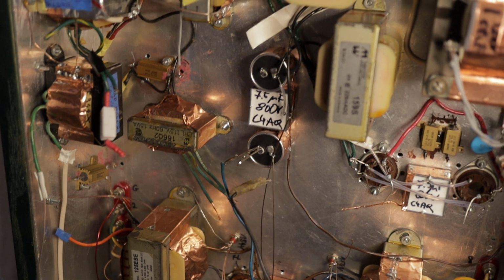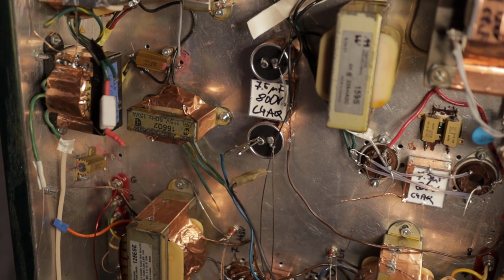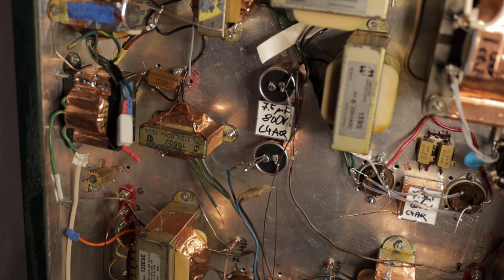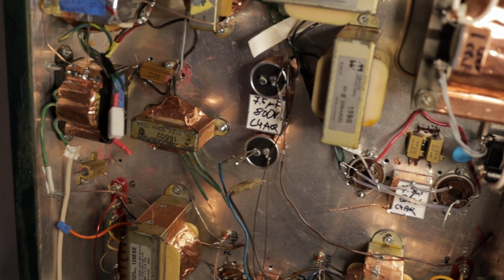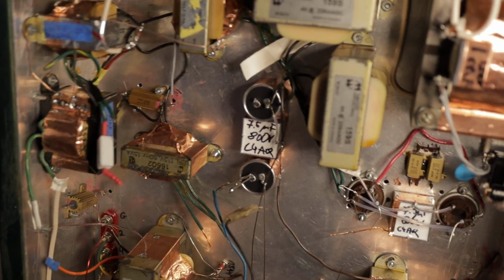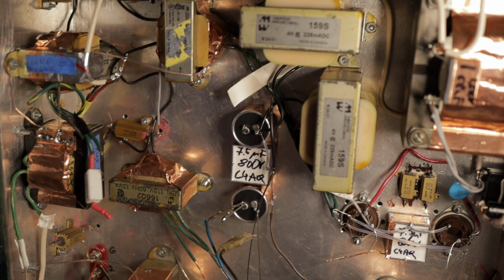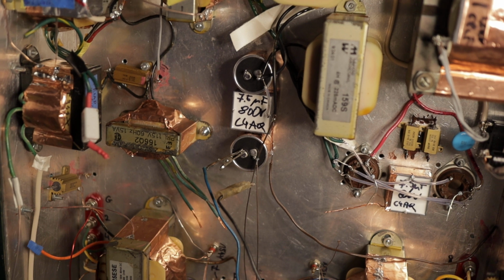And what is very important for these very high voltages, like 400 volts and higher, or even if it's just 50 volts, but a solid state amp with massive, huge capacitor banks, keep the bleeder on while you are working, because even though you have drained it to 0 volts, many of the capacitors have so-called memory, and they will recharge. So if you drain these guys here, within a period of time they might recharge up to 100 volts by themselves and give you a nasty zap. Especially the big oil capacitors, they have a tendency to have an extremely good memory, so they will recharge up to quite high voltages and give you the nastiest shock you never expected. That's why keep the bleeder on at all times when you are working with an amplifier.